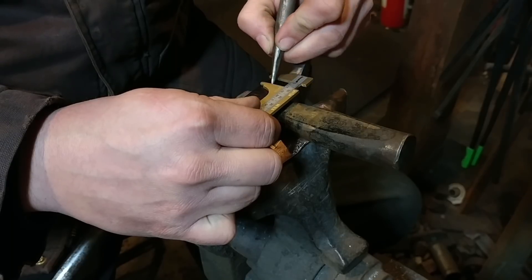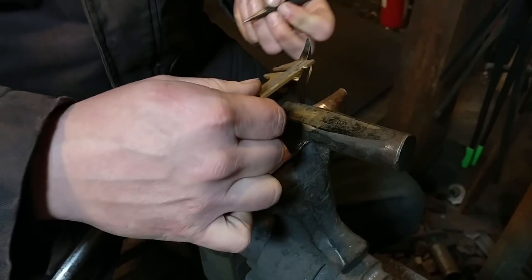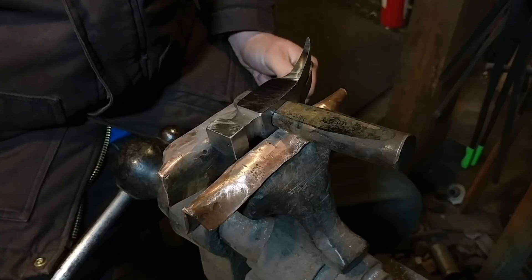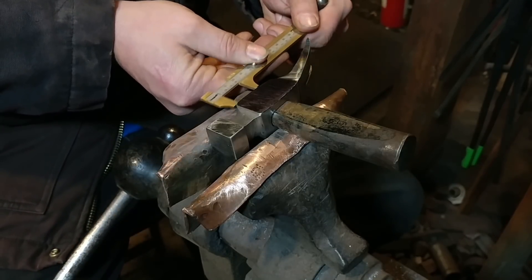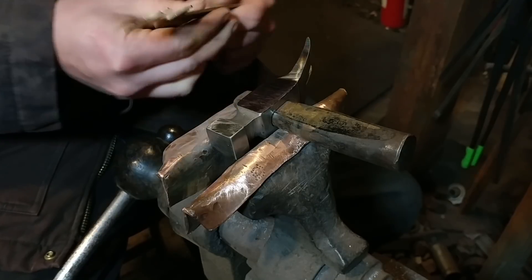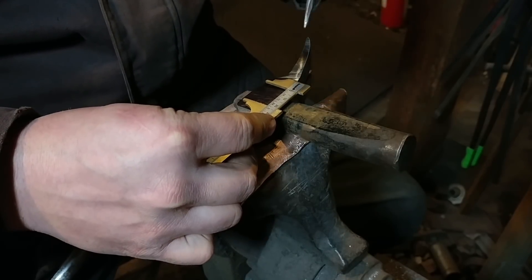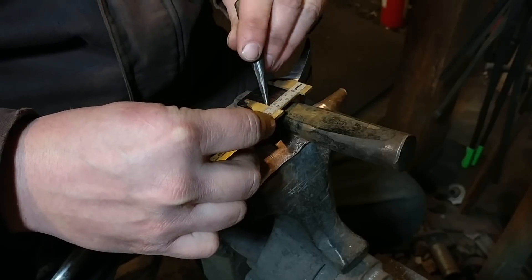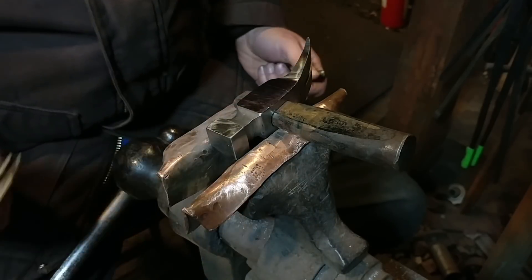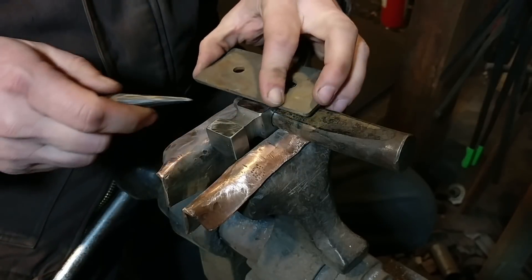What we have going on here is pretty simple. I'm just laying off material with a scribe, and I've darkened out the cheek of the hammer with a little bit of permanent marker. All I'm doing is making sure that all my dimensions are roughly the same, so I can mark this out on the other side as well. This handy tool I'm using I picked up at the local Home Depot — I'll put a link in the description. It's essentially a caliper of sorts and has become one of my favorite tools in the shop for marking out things accurately. You can get a fine degree of detail and it reads both in metric and imperial.